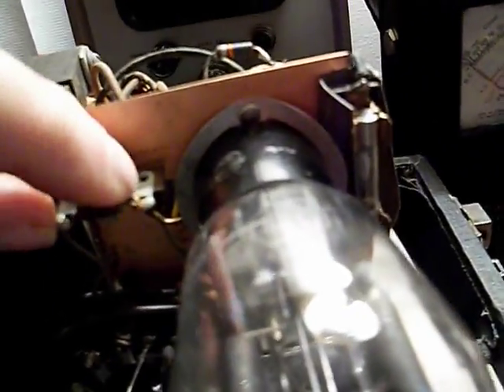This guy's gotten hot — that's not a good sign. This resistor looks like it has gotten quite hot. Let's see if I can see where it's going. I don't know what's happening with that — we're going to have to check into it. I can't even read the value. The way it's installed on a standoff like that makes me a little bit nervous. Maybe that's some kind of a fuse resistor or something.